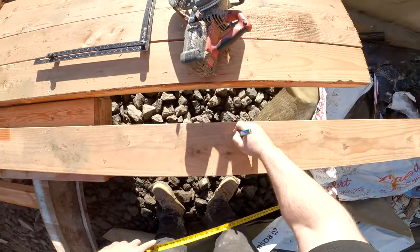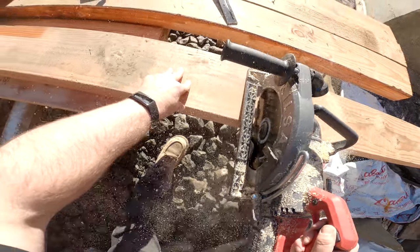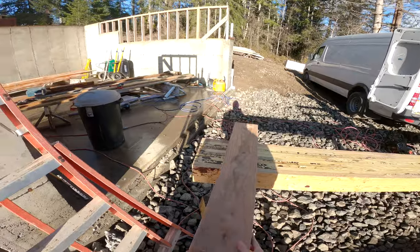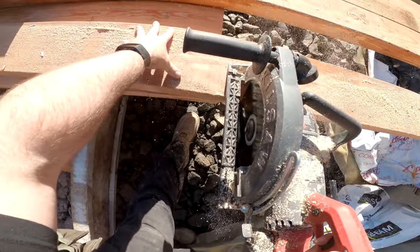Now, I'm cutting a lot of 4x8. Basically, this basement level front garage portal walls were all made of 4x8 material — the mud sill and the studs, king studs, etc. The reason for that is the 8-inch stem walls. We have to fur out on either side for drywall and siding, so it's a lot easier to frame out of 4x8. Again, the beam saw came in perfectly handy for this.